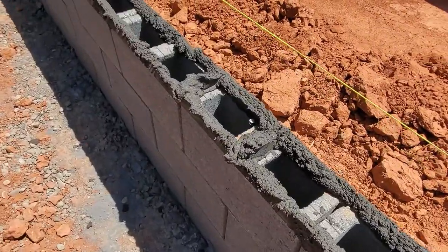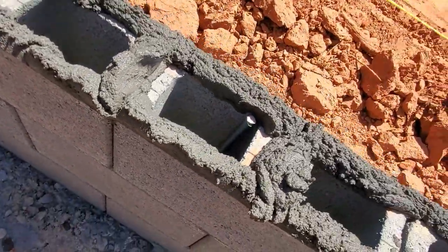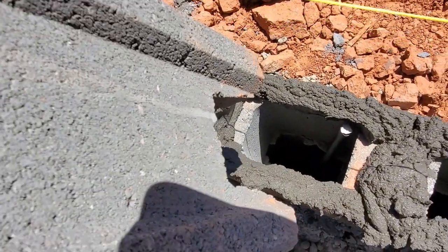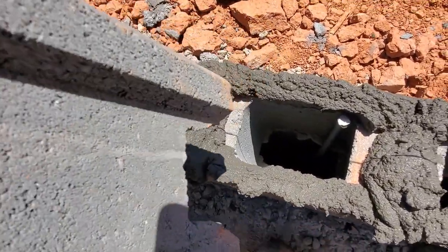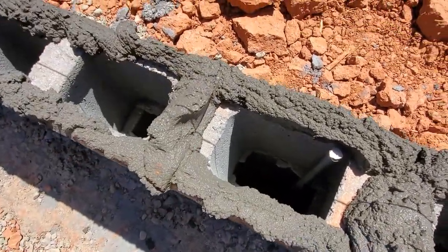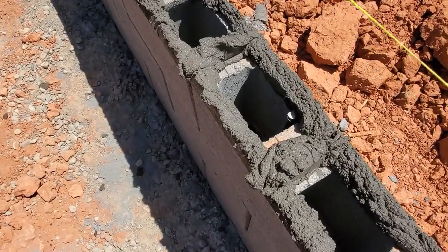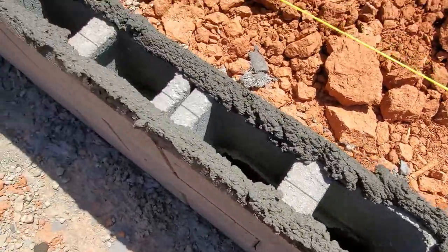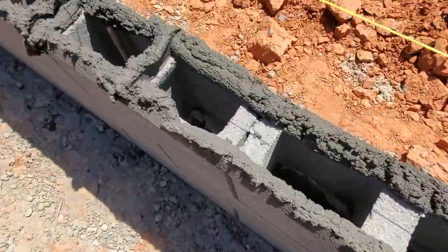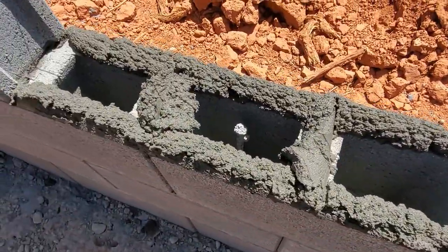One thing that can help if you're not grouting your wall solid, so you're trying to not put this bond over that rebar cell, because if you do, set it on there and it runs sideways. But if you have a bad habit of putting a bond there, you can put some mortar on both sides of each rebar like that, and it'll help slow it down from traveling horizontally when you don't want it to.